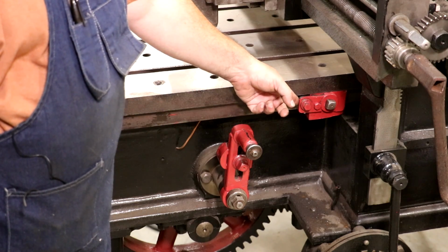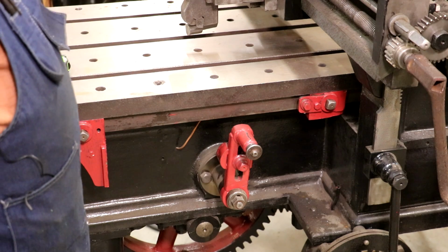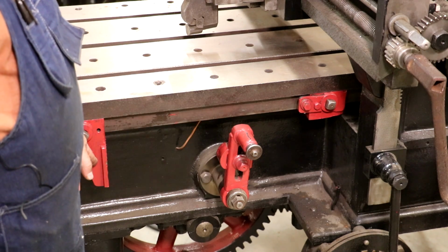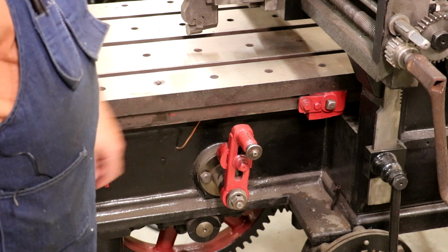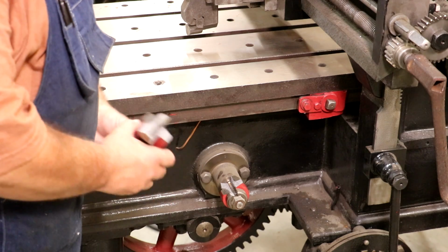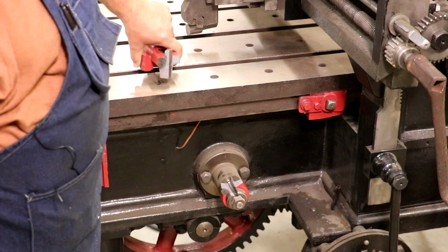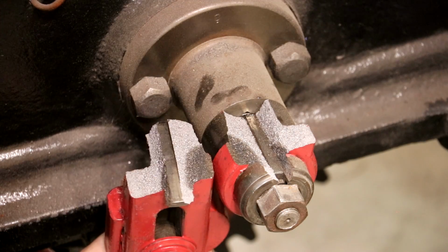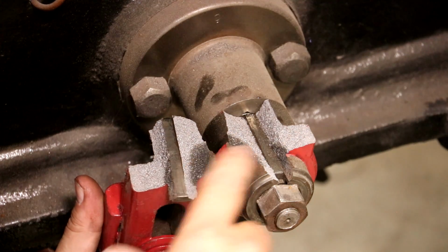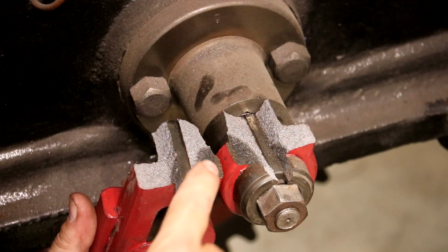It hit this dog, tripped forward, moved the belts, started moving rapidly forward, and this piece up here is not made to be hit at that speed. When it did, it broke. Now, in defense, I can look in here. Let me zoom in and show you this. If you look at the broken casting, you see this stain here and on this side right here. This piece was already cracked.